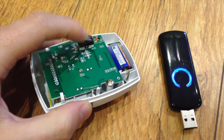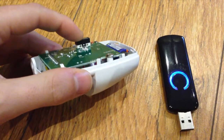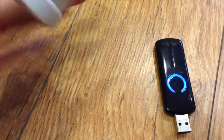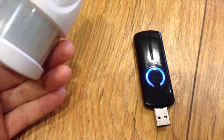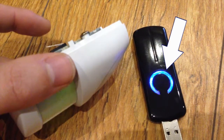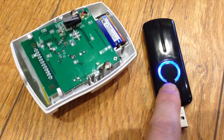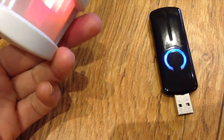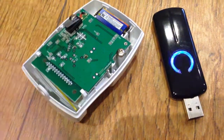That didn't work. Let's try pressing it again — still nothing. There's a flash on the Everspring but the Z-Stick still thinks it's not included. Then — three quick presses on the Everspring, and you'll see there was a triple flash on the Z-Stick, which means they're now paired. There was also a red LED on the Everspring. Three quick presses of the trip switch did the trick.